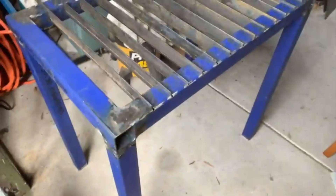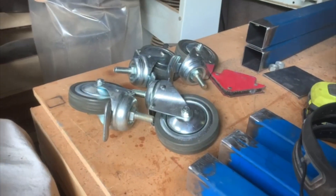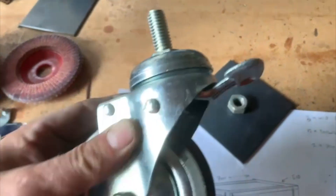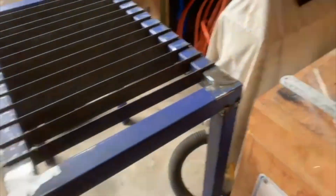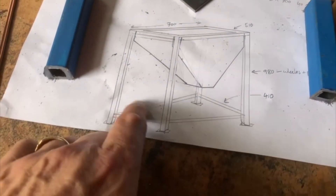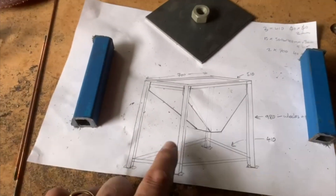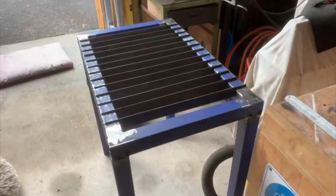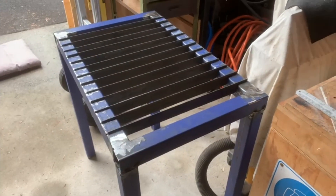I got this far for today. The welds are okay. Put the legs on and basically cut them down to height. I'm going to put these casters with locks on them via a plate — a hole drilled through it and then a nut welded onto the plate, so these will become adjustable feet. They can go up inside the bottom of the feet. There's also a lower frame to go in for a shelf which will hold the bucket and hopefully the plasma cutter itself. Plus these handles here will just enable me to wrap up the table. I think for today, not bad — pretty good effort. Looking forward to getting this done, especially building the little outrigger which will have the ArcDroid on it.